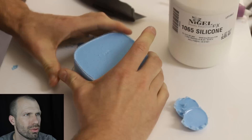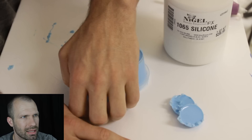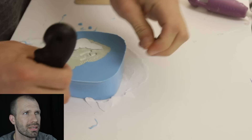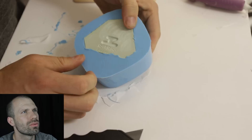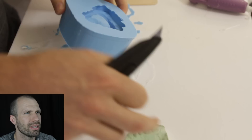Now, because it is hot glued to the board, it is hell to get off because that hot glue really sticks, and the surface is paper, so I actually have to rip up the paper. As you can see a little bit of the silicone got up under the teeth, which is fine — you just want to make sure you hot glue down the teeth so they don't float up to the top of the silicone. Now I'm just cutting a little bit of the excess silicone from under the teeth and pulling out the teeth — it should pop out just fine.